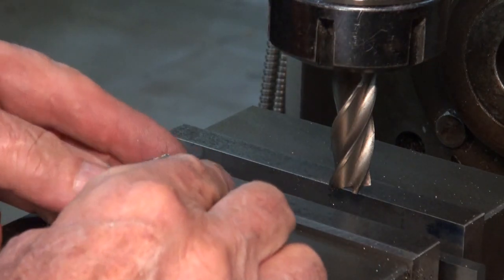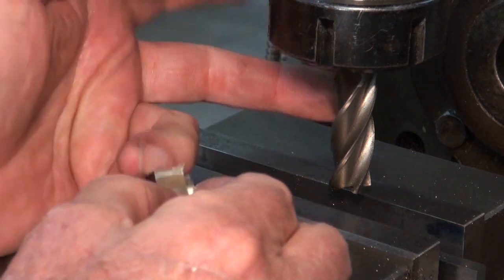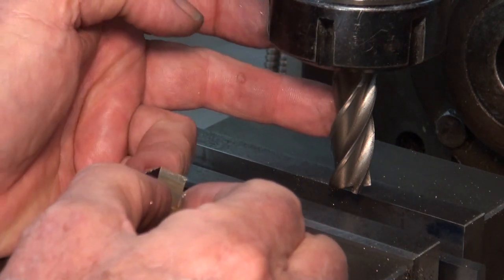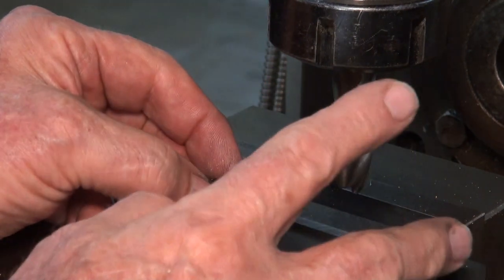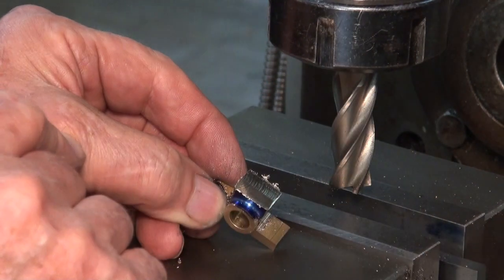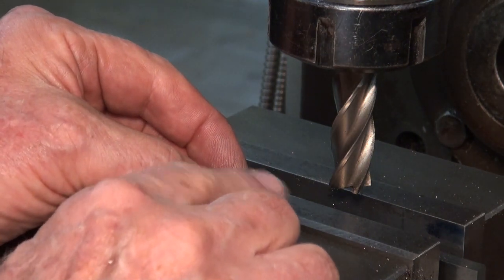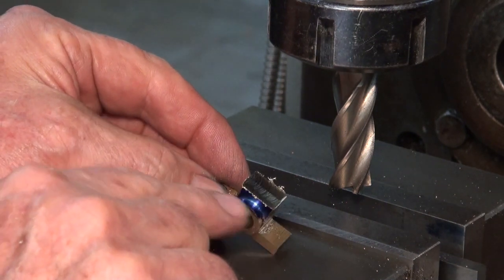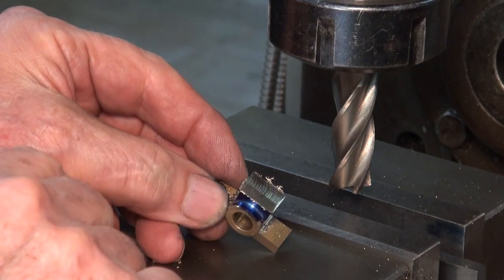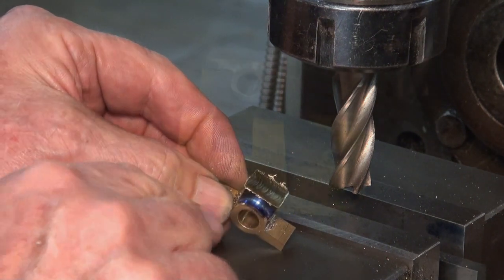Alright, it's got a few burrs on it, as you can see. It's not very clean. This is the same milling cutter I used to do the cast iron base, and I believe any machine tools you use for brass you should use only on brass. The minute you touch them on steel or cast iron, they are no longer sharp enough to give you a clean cut, but that'll clean up okay. I'll just give it a light filing and some sanding on emery.